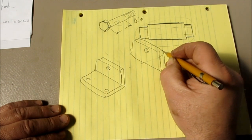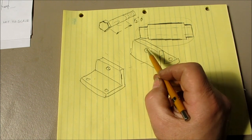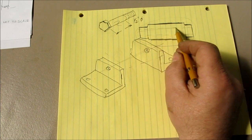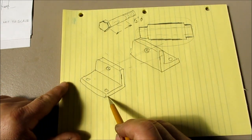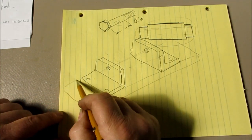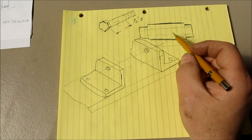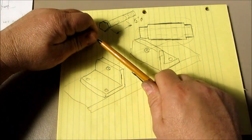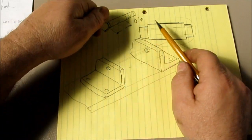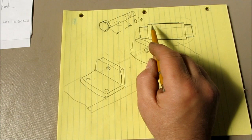So this is going to be your lathe bed, right? What I would do is put a rod through these, through your part, and then screw this to a piece of plywood or something like that. Now you can run this with your drill motor, and then you can just put a file on here and go back and forth with a file. You could even put a tool rest here to hold the file nice and straight.